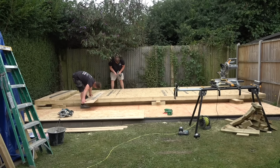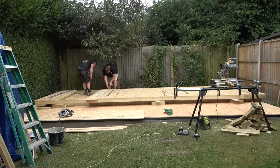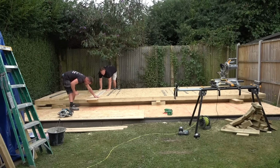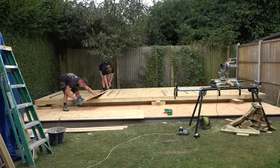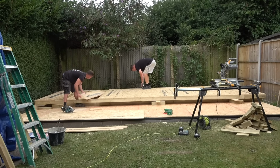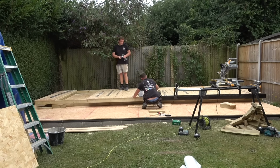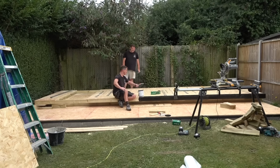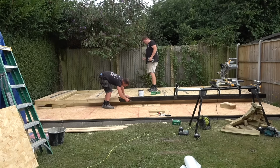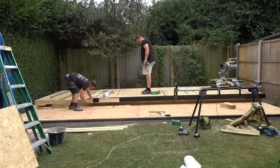You can't get away from it because the whole length of that frame is not an equal measurement for our beams. So there will always be a point, and normally that point will be on the end of the building. But because we put the door in, we've also measured our door 600 away from the outside edge. And we've done this because I didn't want the door right on the end. I wanted it offset slightly, so that as we walk in the door, on the left hand side, it will be deep enough for me to run enclosures down that wall. Otherwise, we would have ended up losing 3 or 4 feet of wall before I could start putting enclosures in because of the door. So this is why we've done it the way we've done it.